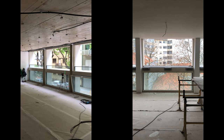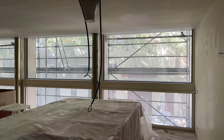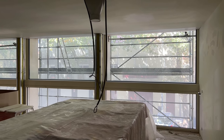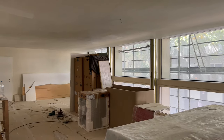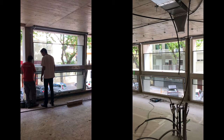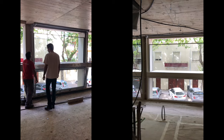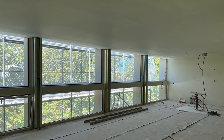Now that we're showing you this, we must tell you that we will never ever do this again. This was a mock-up for the ceiling of the windows in the living rooms — such a pain to work out. You see the outer window — you hardly see it, it's just that frame out there. This is the inner window, and all the rest — above and below — is a system of what we call pre-frames. There's more aluminium in this pre-frame system than in the frames themselves; they're seven-centimeter thick aluminium.